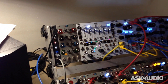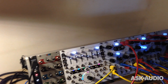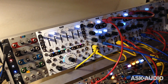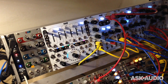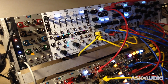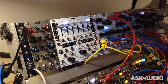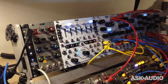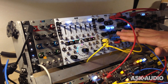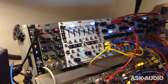It also can be run at audio rate, which is a really cool effect. If you patch a VCO into the ping time — which is the delay time — you can do very short delay times. With feedback it turns into a resonant delay. You can do Karplus-Strong type sounds. You can do a very ambient, drone-y type sound just by feeding a simple triangle wave into it. Playing with the feedback and the delay time gives you comb filtering effects. Pretty cool. Very clean, very low noise — we've worked really hard and used high quality codecs to make this the lowest noise Eurorack format delay looper that we've tried.